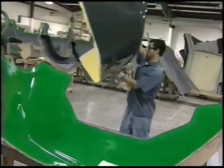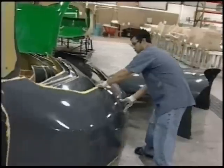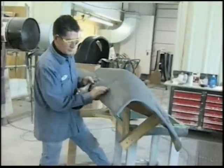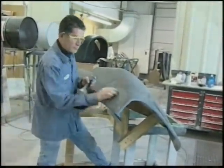After the part is taken out of the mold and inspected, any imperfections can be readily corrected by using the Duratec primer. The surface can be quickly shaped by sandpaper to correct voids, thin primer, or any other minor defects. This makes the last part of this process very cost-efficient.